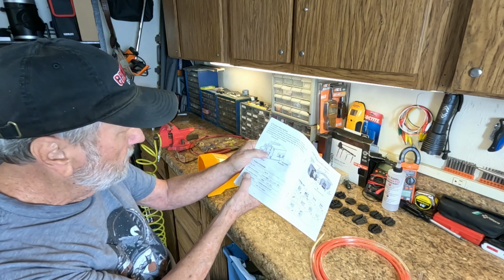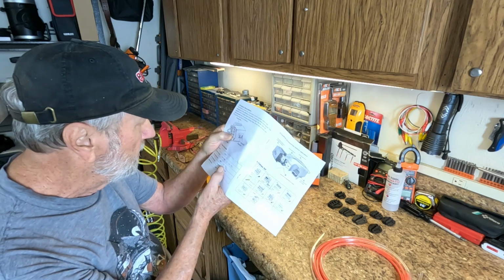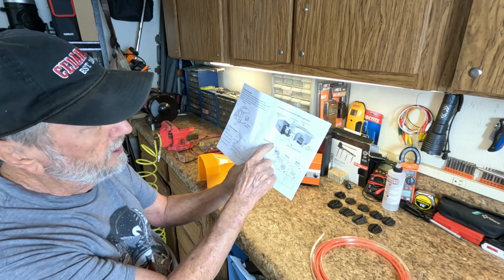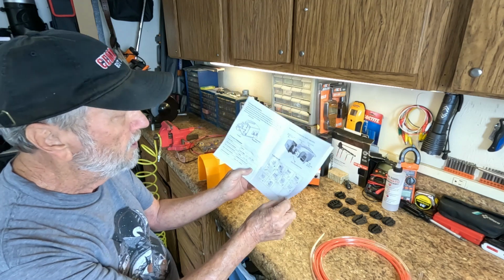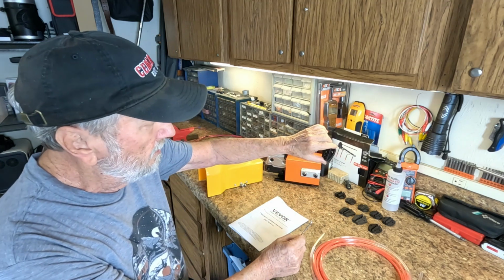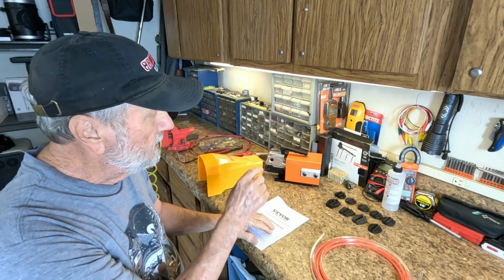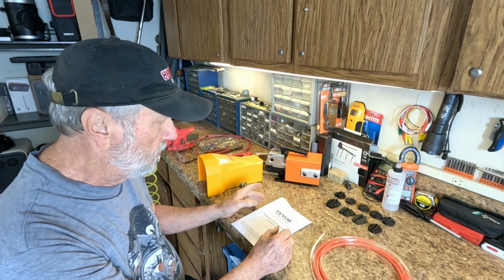The absolute maximum operating pressure is 149 psi. I'm sorry, 145. That's 1.0 MPa. They show all of the clamping list right here and what types of clamps it will work with. You also get an Allen tool, which is going to help install and remove the die sets for your job application. We'll demonstrate the use of that after we do one particular demonstration.